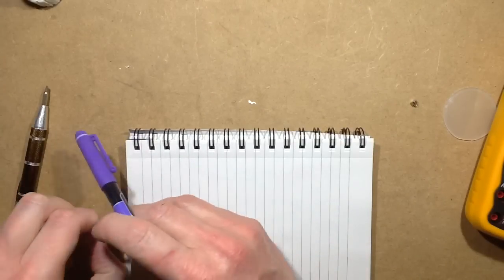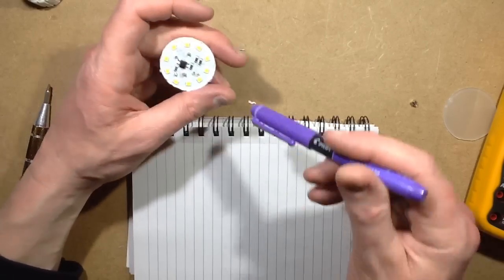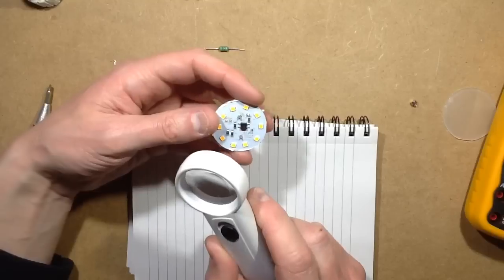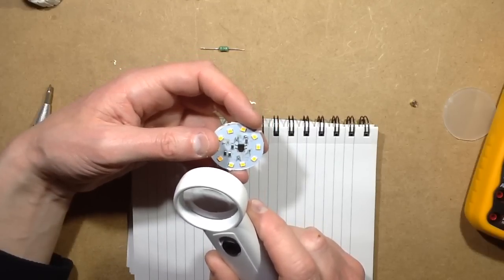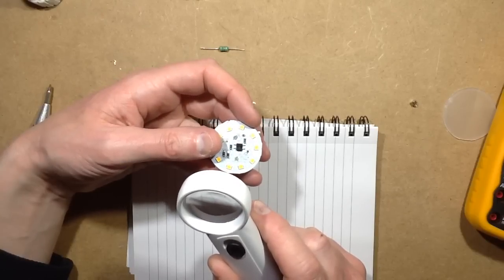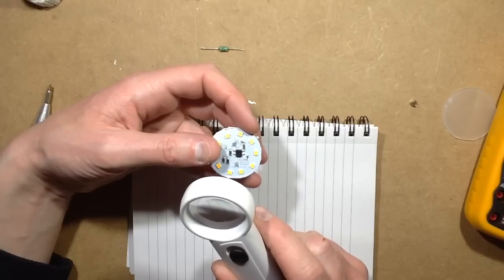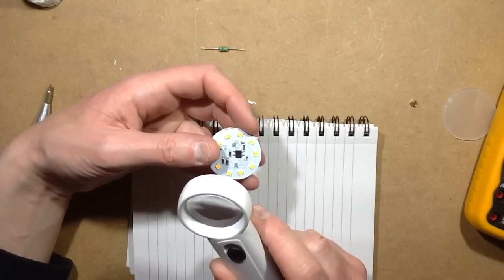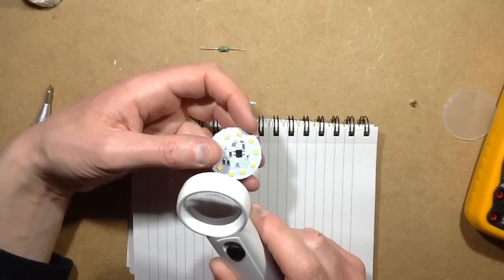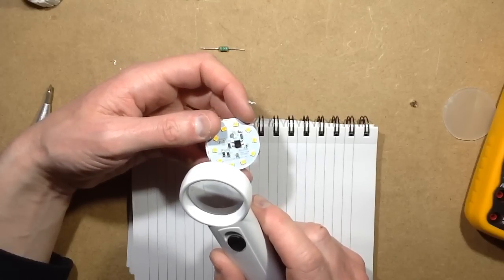This reminds me, the other lamp I've seen that had the inductor in it was one of the Philips 2-watt lamps that also used a capacitive dropper and the multi-chip LEDs. Now I see text on this circuit board and it says YX-LED. Now is YX-LED not named a company? ZR-038-10C-A2. I'm guessing the 10C stands for 10 of type C LED. 38. What was that current? Was that current about 38 milliamps? Oh, I can't actually remember now. I thought it was less than that.